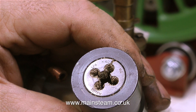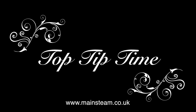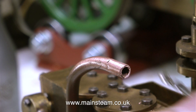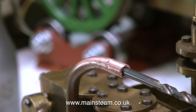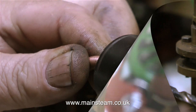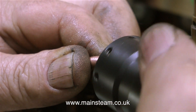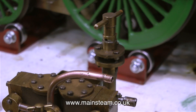The next thing I need to do after cleaning up the end of the pipe is use a tailstock die holder with a quarter by 40 threads per inch die fitted. And now it's time for a top tip. It's quite straightforward to thread copper pipe but you must have a support fitted internally. The diameter of the internal part of a quarter-inch copper pipe is 5/32 of an inch, but you don't need to look around the workshop for a piece of 5/32 bar — all you need is the drill shank of a 5/32 drill bit. You also need plenty of lubrication, back off the die to clear the chips frequently, clean out the die, and most importantly keep the die holder perfectly in line with the copper pipe. If you do all of those things you should get quite a clean thread like this one.